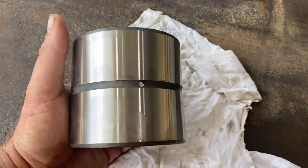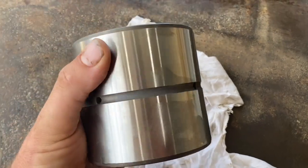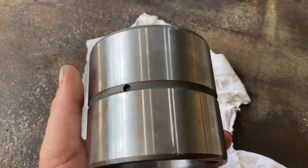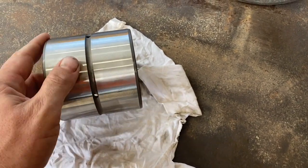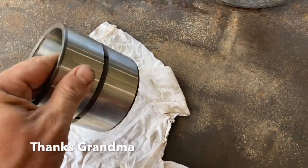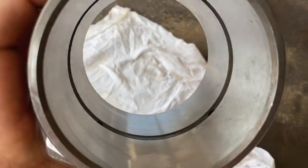Now the thing's super hot — I'm not going to want to put my grease seals in or pick it up and put it on straight away, which I can do when I freeze them down. I can rock up to any job site with grandma's Toyota Corolla and an Esky in the back with some liquid nitrogen, freeze the bushes down, throw them in, and give you the thumbs up — away I go.